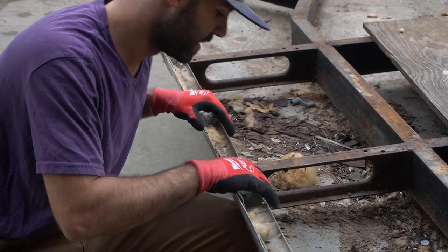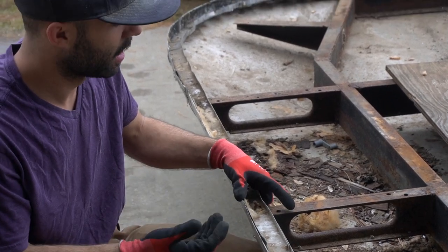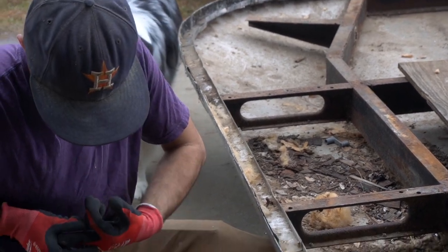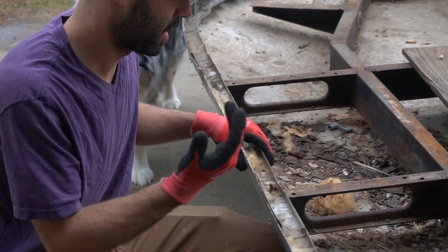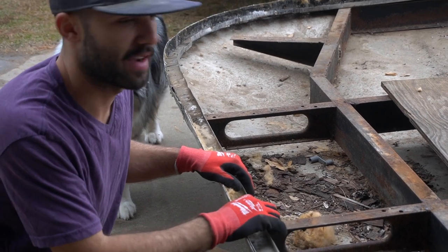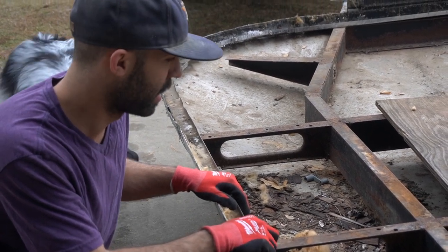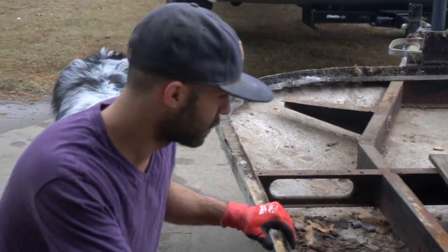We had our second day of light showers. On these 60s models, the C-channel just sits on top. In 70s models and later, your subfloor would actually go inside part of the C-channel. This year model literally just sits on top, so it's a lot easier. This is 5/8 inch subfloor for this year model — or 19/32 — whatever you can grab at your hardware store.